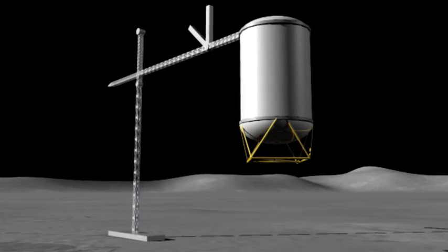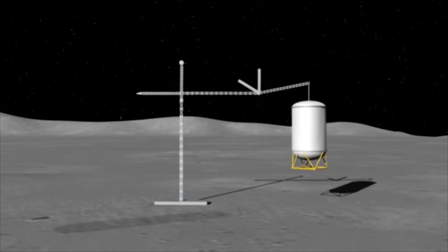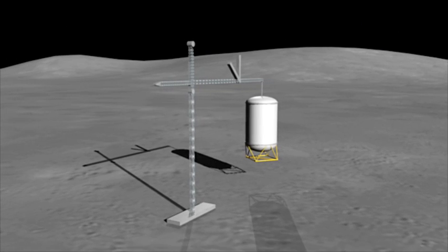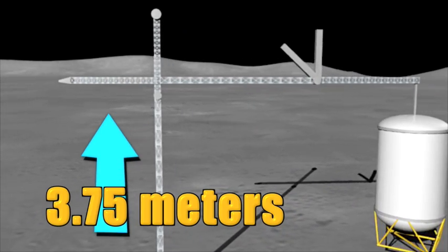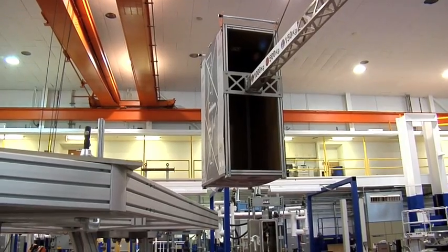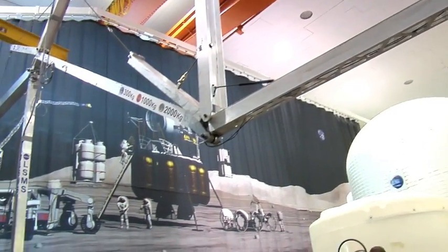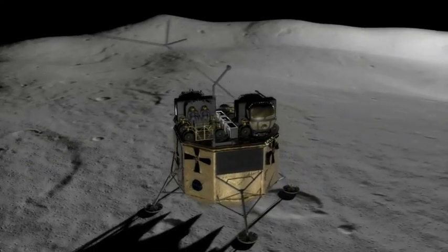For unloading or lifting materials to high places, the arm and forearm would be rotated up 45 degrees, extending as high as about 9 meters above the surface. When reach is more important, it can be configured as a horizontal boom, 3.75 meters tall and stretching out 7.5 meters. For this first-generation prototype, Bill and his team used aluminum fabricated at NASA Langley. For work on the moon, the crane will be made of lightweight, high-stiffness graphite epoxy composites.